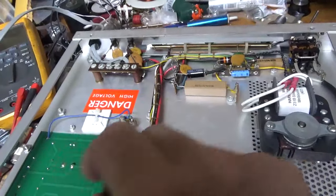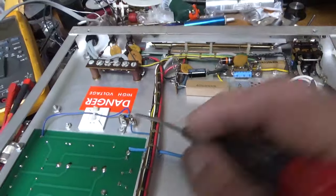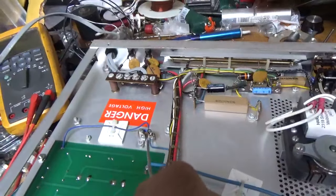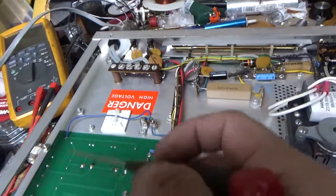Same with the new wire for the high voltage metering circuit. This resistor gets changed when you put the Harbach filter cap board in — the resistor string comes out and then that resistor gets changed. The string is now on the board.